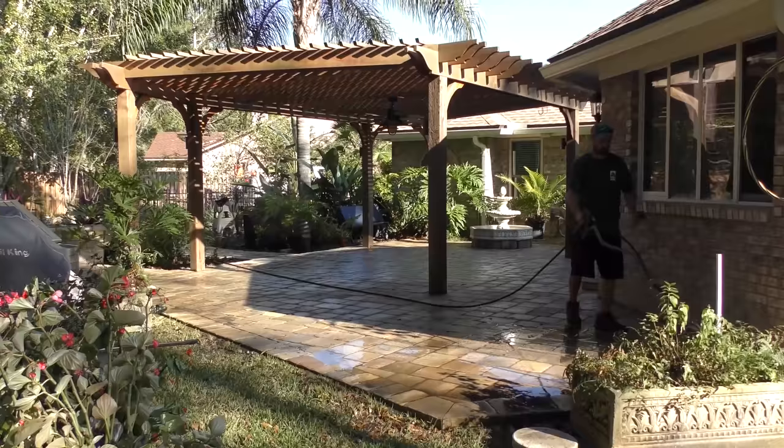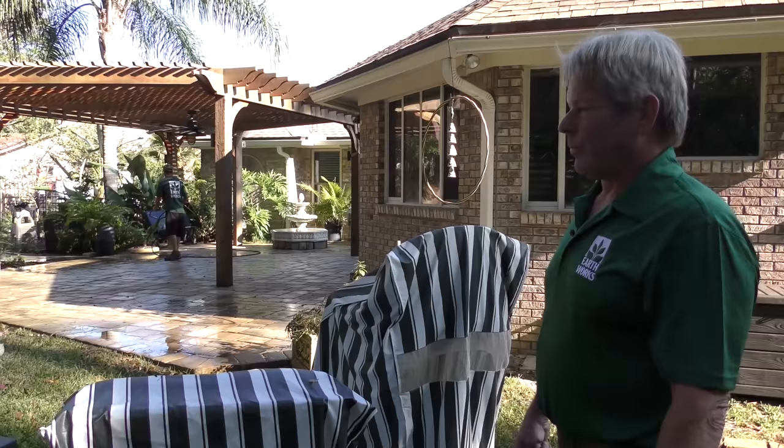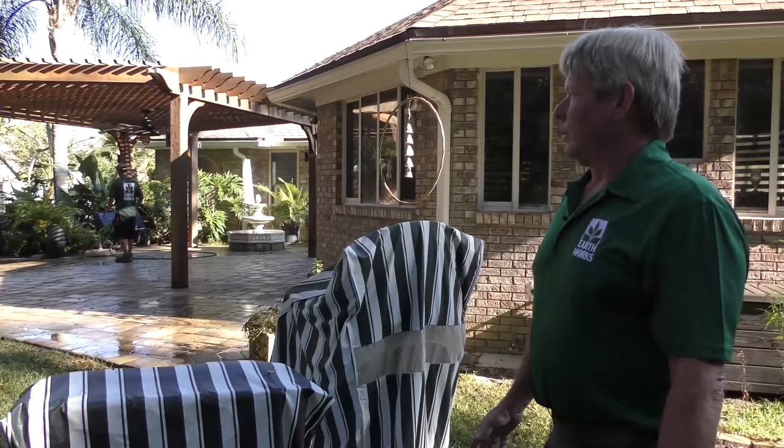Most of the time I do it with a pressure washer. That way I don't have any spots just sitting there waiting to be re-soaked. I'm using a diluted half-and-half muriatic acid, which takes rust right out. Some of the patios we come across are pretty dirty, let's put it that way.